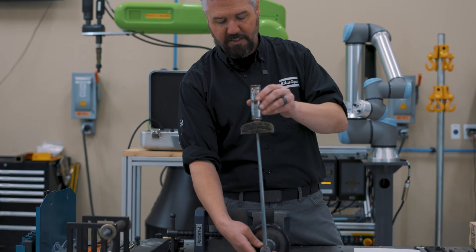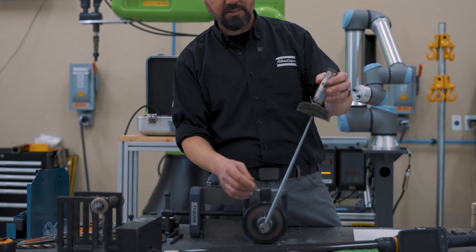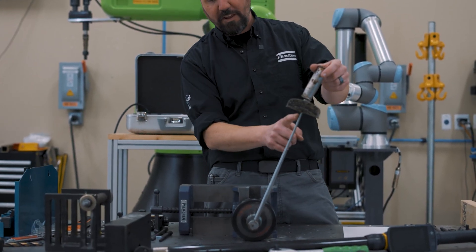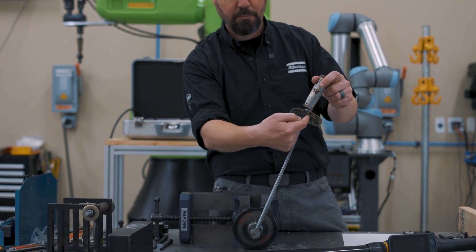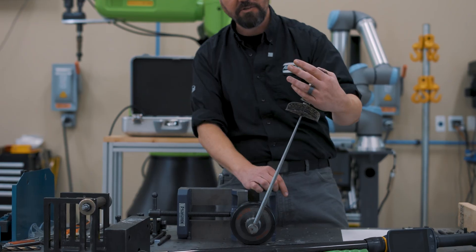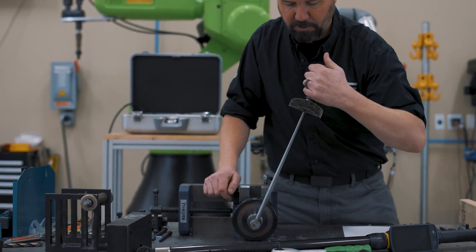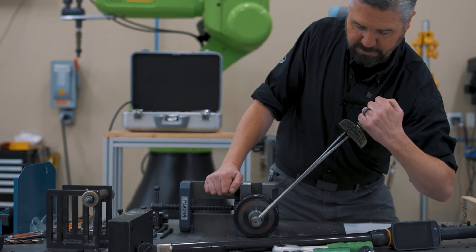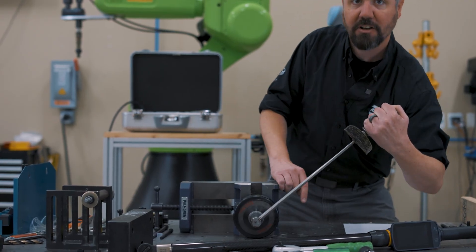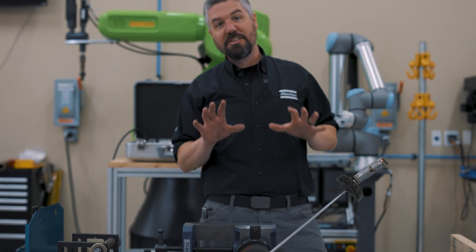If we do a quick demonstration on this, we can see that there are a couple of components. We've got a dial, we've got the beam — this part actually bends — and we've got an indicating rod that points to the torque value we reach. So if we put some torque on this bolt right here, we can see as we turn it we're slowly building up and getting more deflection out of this beam. This is what we're going to try to replicate with a 2x4.